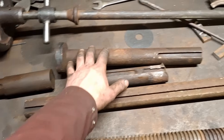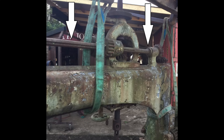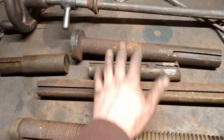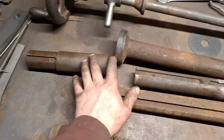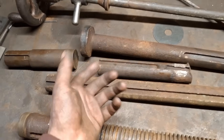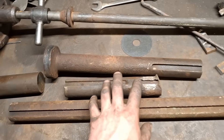This is what is left of the top shaft. Obviously this is the piece that I've had to cut up in order to get various parts of the drill off. I decided to sacrifice this shaft to save parts that were harder to make — this is fairly simple to make. So I intend to forge this and then machine it, here as close to the historic method that would have been used. I have got some suitable wrought iron, so that's going to be quite an interesting process.